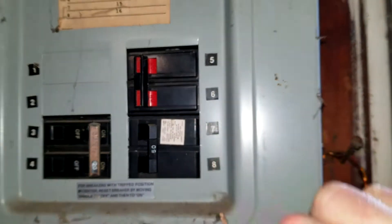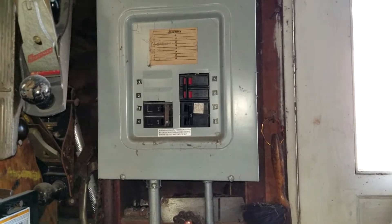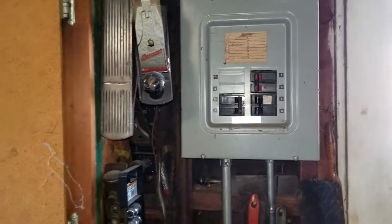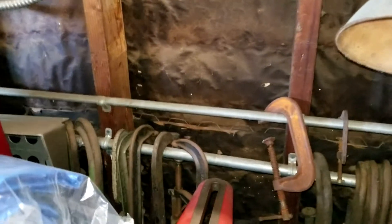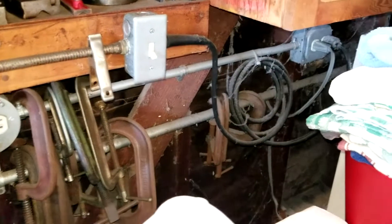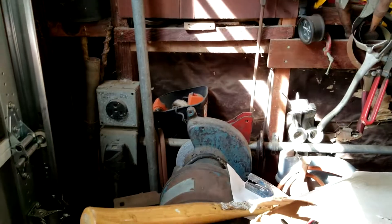There are two different receptacles here. I actually have another electric charger Level 2 plug that only needs 30 amps, so I wouldn't have to put in the 50 if I didn't want to, but luckily it's already there. He has electrical conduit on the exterior — this is the way to go if you're renting a property and don't want to bust through the drywall. You get metal conduit with some brackets, find your studs, and lay it on the outside of the drywall. It's actually a lot cheaper this way. He's run metal tubing all the way down with different plugs.